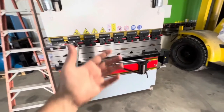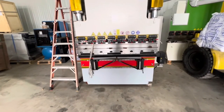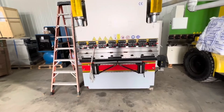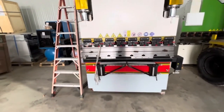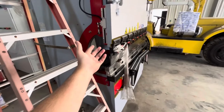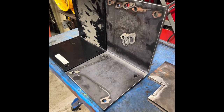You'll have four different V-openings that allow you to bend anything from thin sheet metal all the way up to quarter-inch. If you want to go above quarter-inch on a machine like this, you can — the question I always get asked is how thick can you bend? Well, it's a 70-ton hydraulic ram. You can bend whatever you want with it if you get the right tooling. I've got one customer with a basic five-foot 70-ton brake who bends half-inch at 17 inches on it — he just has the right tooling and the right understanding.